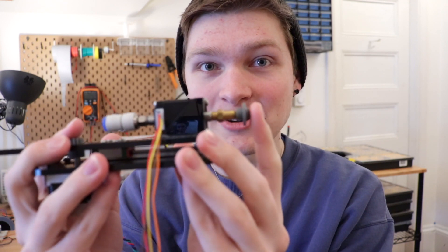Alrighty, we got a Z-axis — I love this thing. The first thing that's immediately apparent is there's definitely some backlash, but again, the nozzle has some compliance anyway so it doesn't really matter. What I neglected to consider was that cutting the laser in the acrylic causes a really tiny bit of kerf — that's the amount of material removed when you're cutting or lasering through something, in this case the actual acrylic vaporized by the laser. I didn't take that into consideration and offset by the kerf, so there's a little bit of wiggle room. Again, totally fine — just a little annoying.